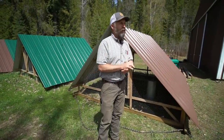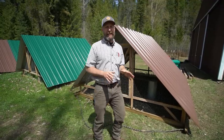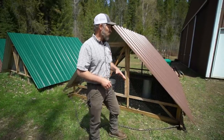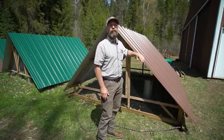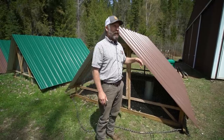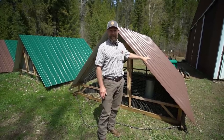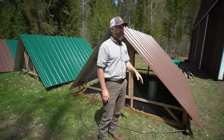In talking about the roof, a lot of people use tarps — that makes it really lightweight, and that's great. It's just not what worked best for me. I was willing to have a little extra weight for the durability and low-maintenance aspect, so I went with a metal roof. In between those options is plastic corrugated roofing — that's not going to hold up as long, but it's pretty durable and a lot lighter. You just want to make sure it's not clear, because you need protection from sunlight. You want good shade and protection from wind and rain.